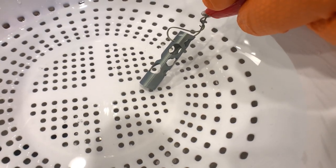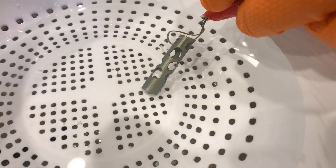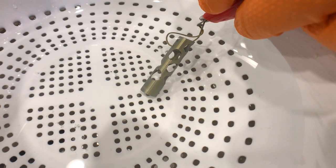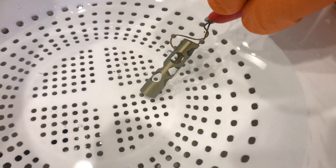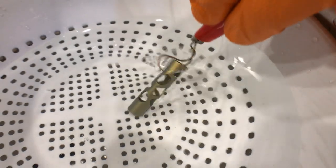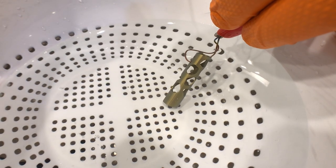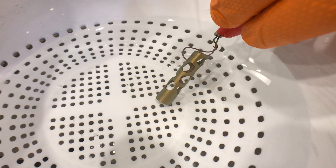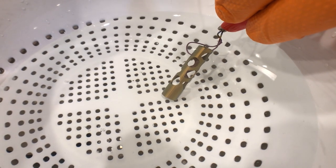A little over 50 volts - we're starting to get into the gold, not quite yet but it's getting there. I'm going to stop here at 60 volts - real close to 60 anyway. Oh, I got my alligator clamp in the water. You can see there - you've got a goldish color. Then we keep going and at about 70-something volts we're going to start getting into the pinks.